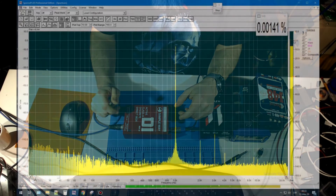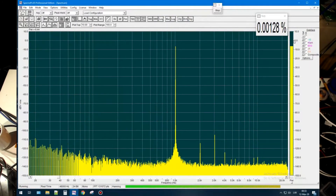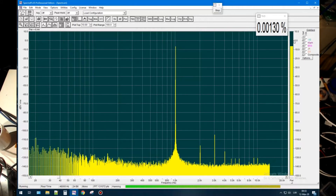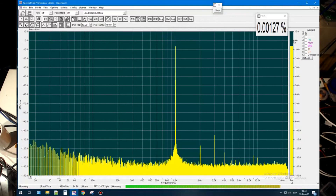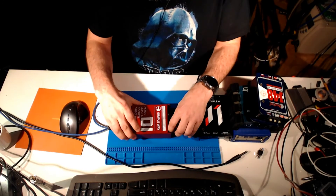Let's take a look at the younger brother, the D1. It's charging — capacitors which were discharged are charging now. We can say it has the best parameters of all DI boxes for sure, because we have no trail at all and distortion is the smallest. By this small test, we can already tell that it is on a J48 level, or maybe even a bit better. But it's only numbers, not sound. Simpleway doesn't have feedback, but J48, Clark, and BSS have deep feedback and try to level off their parameters that way.